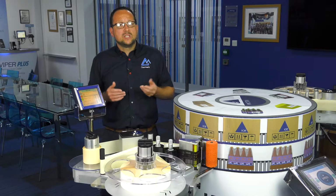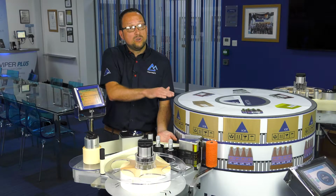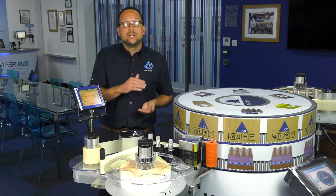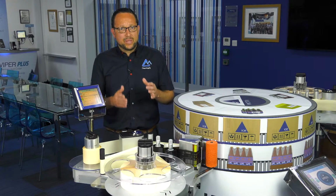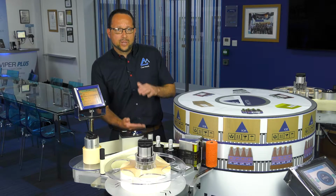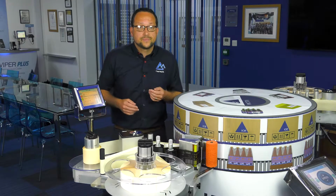So what can we print on a label? Well, print head widths can be from 53mm up to 152mm. The most commonly used head being the 107mm. In direct apply format, this will print a label up to 110mm high and apply it straight onto the side of the package as it travels along the conveyor.